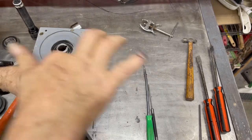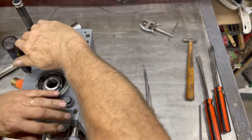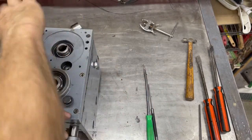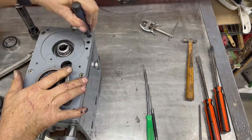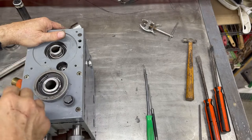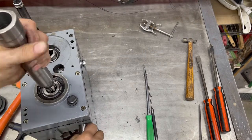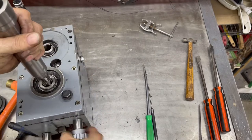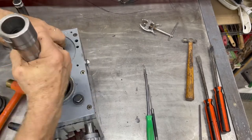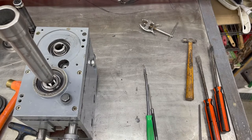Okay. I got them all snug down where they're hitting. Classic X pattern. Oh, I see sealant. Now, the thing about gearboxes too is when they're dry and clean like this, they're noisy. So you don't worry too much about some funny noises, unless it's binding and stuff. Let's try it again. Well, wow, seems like it's kind of bound up there. Take a break. Something's under bind.